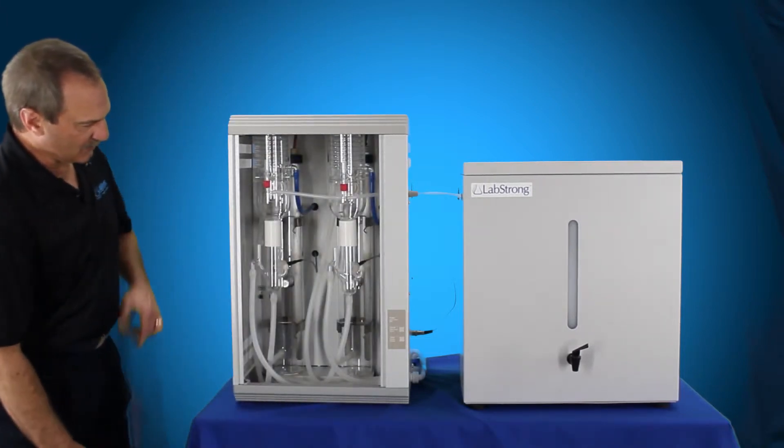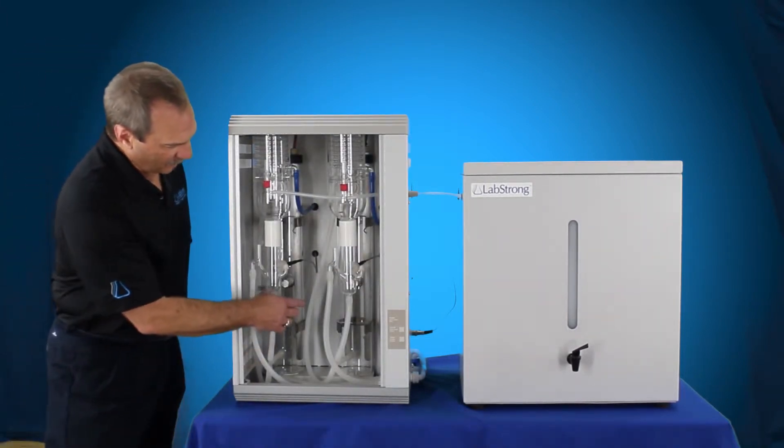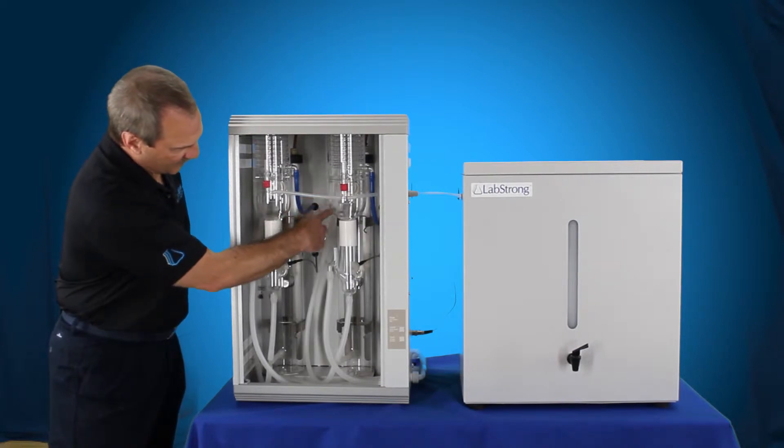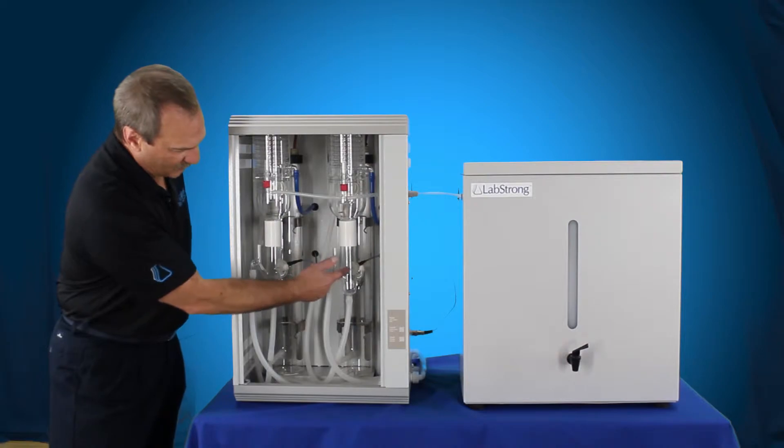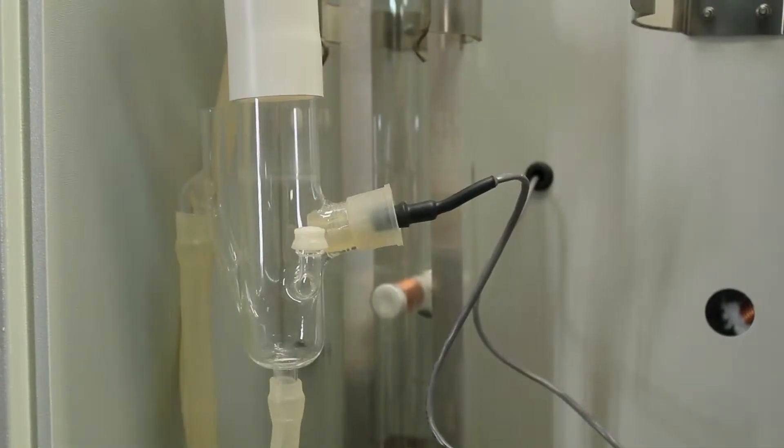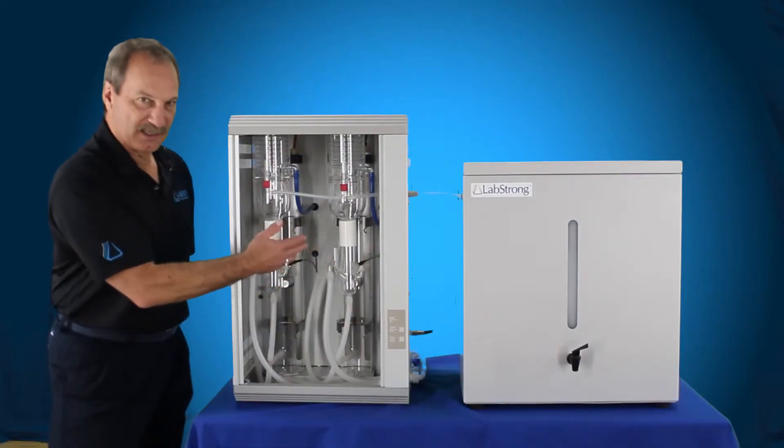Basically, remove the doors so you can see this better. It's going to fill the boilers through the condensers, because this is a tap water system — coming through the condensers, down into the boilers, filling up the boilers. When it hits the thermistor right here in the constant level device on both of these, it's going to go ahead and turn the elements on and energize those.